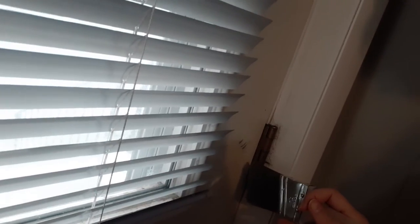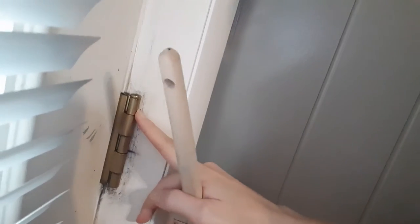For the love of God, do not paint hinges or anything metal. Metal and paint is a no-no. Never paint hinges. Don't paint doorknobs, don't paint anything metal — little knobs and stuff. Never. Don't paint anything that is plastic or metal — that takes a special type of paint, usually a spray. And even then, you still don't paint hinges. Regardless of how bad the hinges look, replace the hinges. Don't paint them, because the paint gets in the cracks. If paint gets in those cracks, that hinge is going to end up squeaking like hell, and putting WD-40 in it won't do anything because it's being stopped by the paint rubbing against itself — that's what causes the squeak. Replace the hinges if you have to. Never paint them.